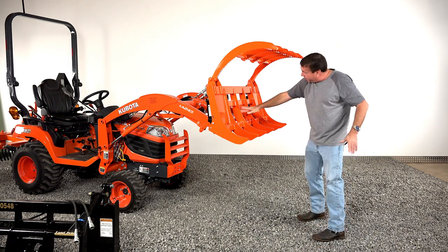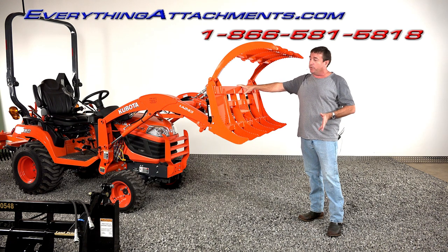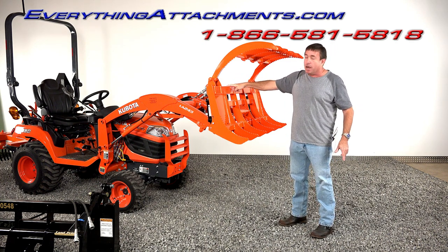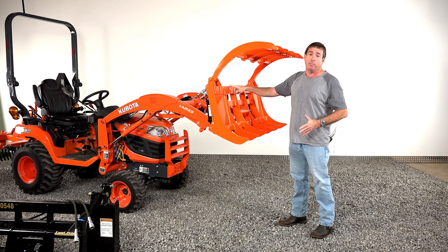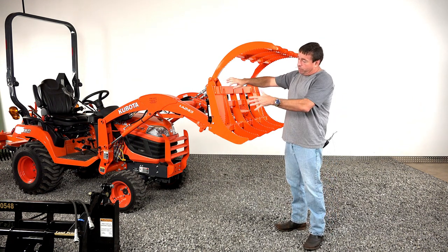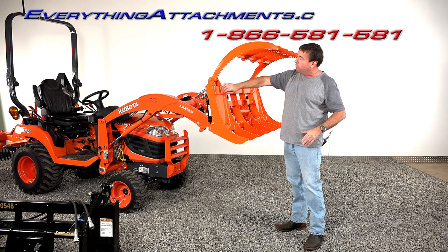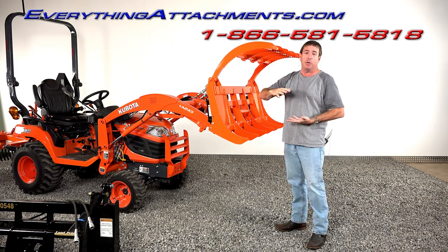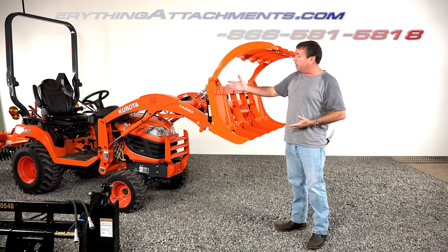We've put our Wicked logo in here. I've seen this grapple on the internet as a Land Pride and it seems like they've gone through at least four or five different versions, because at first these pieces that hold the lid were just tacked on to the top and were only welded on one side. At Everything Attachments we double weld everything — we don't tack weld, we don't stitch weld. If it's there, we weld it. On the newer Land Pride grapple we have sitting on the floor, they did come down and give it some support on one side but not on the other. You need it on both sides — one for clamping force and the other when you rake. So we did it on both sides, double welded on both sides.